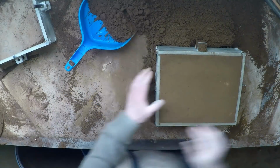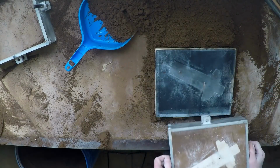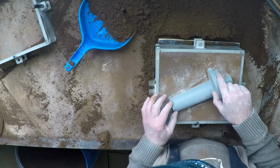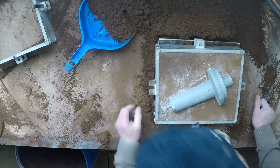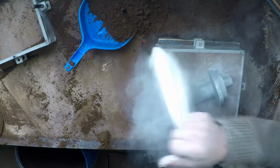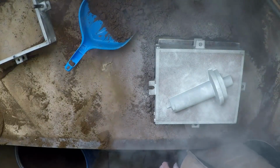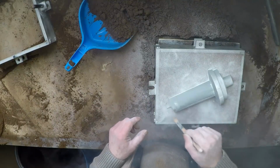Alright, drag half rammed up, flicker over, back on the boards. Other half of the pattern, sitting nicely, not too bad. Plenty of part. Get it off the pattern.